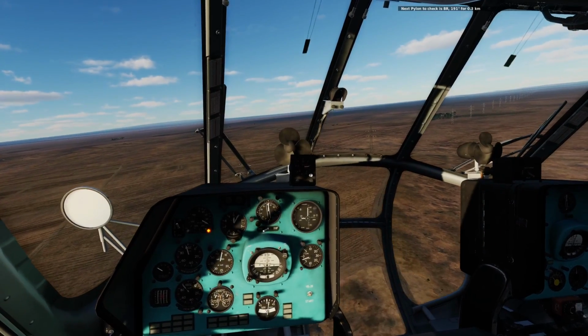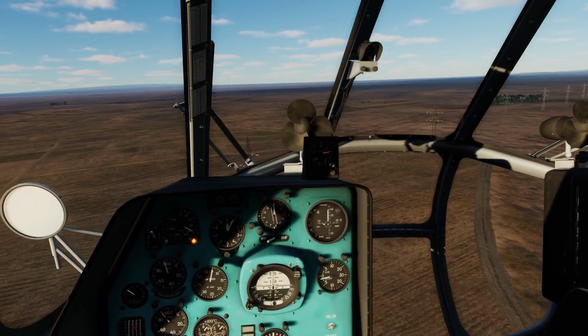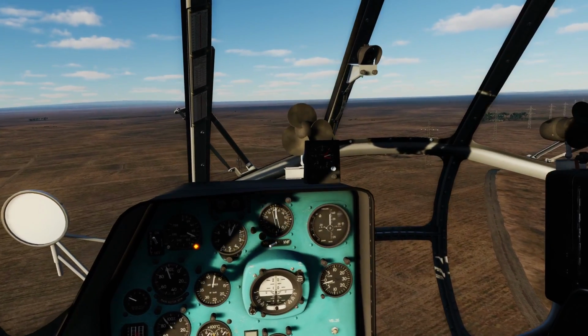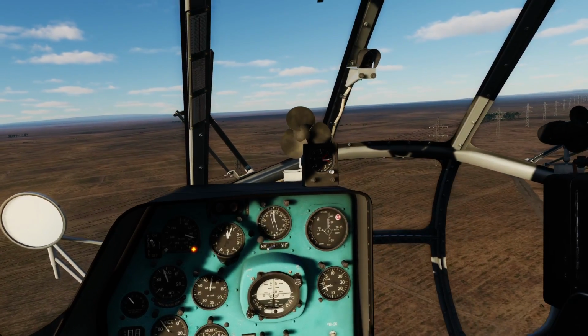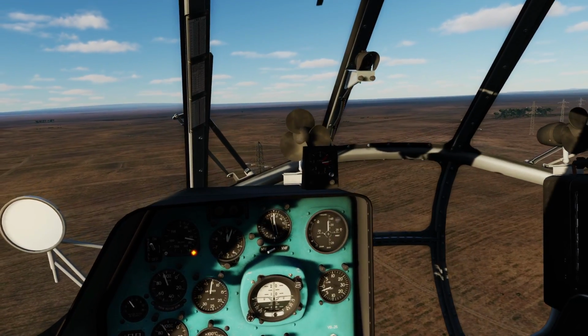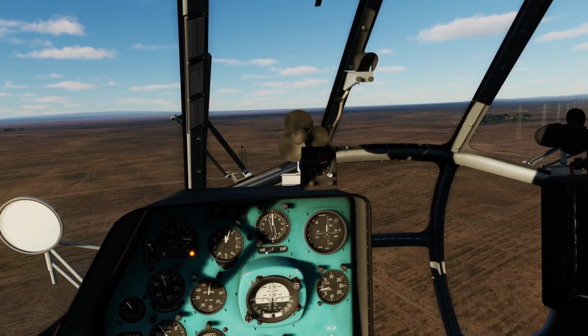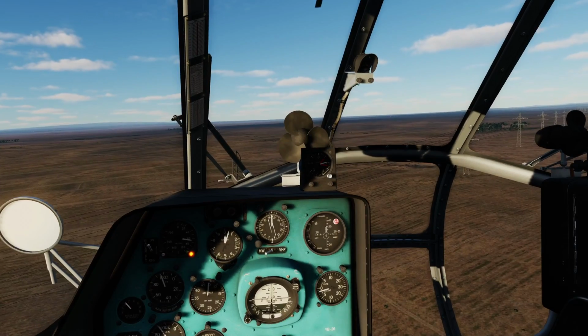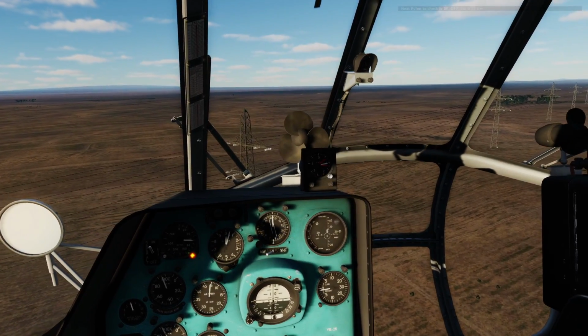The mounting mechanism, which uses four small screws, a washer, and then a large nut on top, is pretty secure. I've taken it on and off a few times, moved it around. Just make sure if you do that, you put all the screws in as tight as you can. Don't wring the head off, but get them in there darn tight, and then get that locking nut down tight as well, and it won't work loose because there's a lot of force on that.